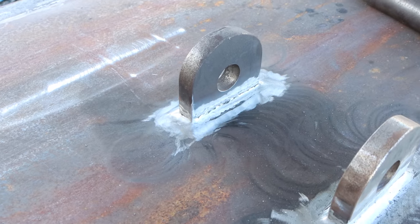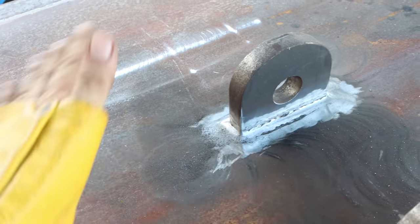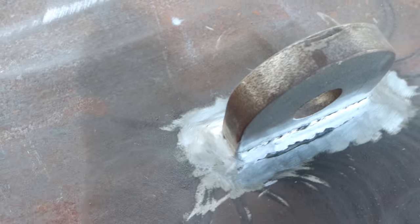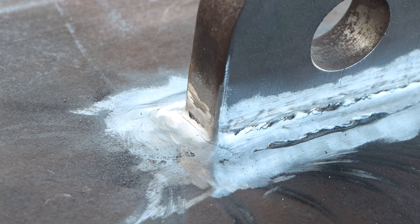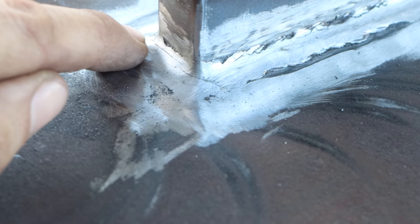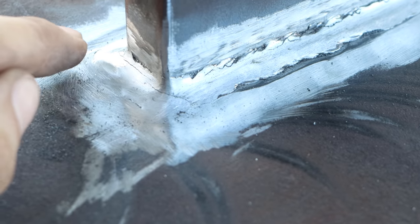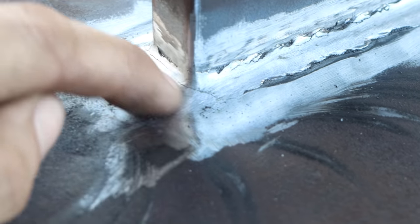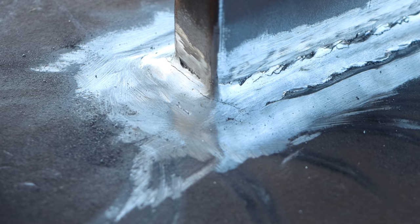So when you're doing really critical welds and you want to know if you've got cracks, just dust a little bit of grinding dust onto the area you want to crack test, give it a quick blow off, and you can see right down in the corner. See those little lines right at the base? That's a crack. Iron is magnetic and gets attracted to edges easier than flat surfaces - so it sticks to the crack. I've got a crack that starts here, goes across to there and stops, and another one just below it - they probably link up underneath, so that whole front face is basically not bonded properly. I need to grind that back and do a proper weld in there.